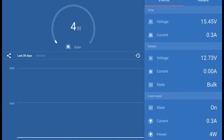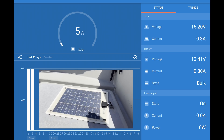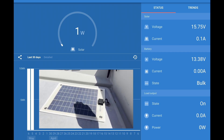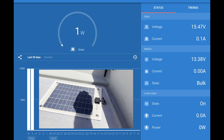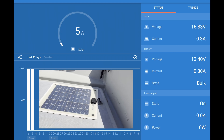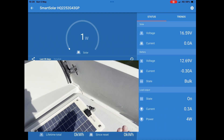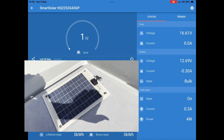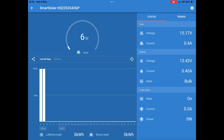One of the things I really wanted to look at was the effect of partial shading on the power output of these panels. About 6 watts here on the following day. It doesn't take very much shade — just a couple of those cells to be covered — and the power output drops really quite dramatically. You'd expect that covering half the panel gives half the power, but it's nowhere near that. 50% shading drops the power by a factor of 5 or 6 at least. I actually get more energy out of this panel on a cloudy day than on a bright sunny day with some partial shading.